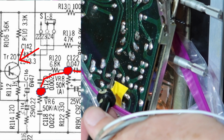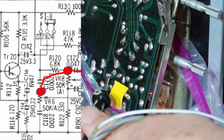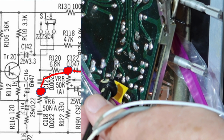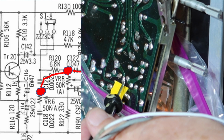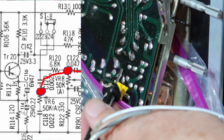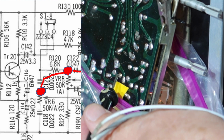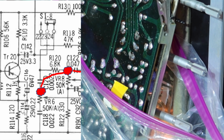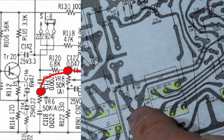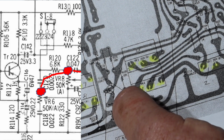There it is. Okay, so we hear it at this T piece. I do not hear it at the end of this long snaky piece. And I don't hear it on the toe. Right, so transistor 20 has 2 silent legs and a noisy leg right there. So if I look at this, that noisy leg here appears to be the collector. That looks like the collector, right?